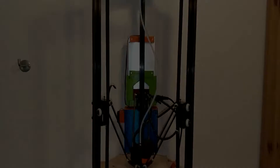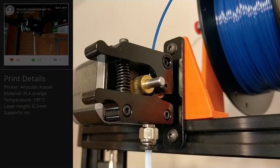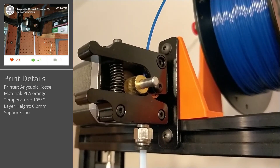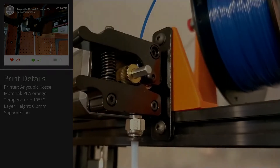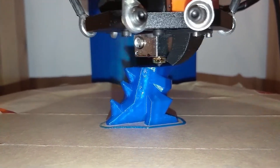The design not only reduces the printer's footprint but also makes it look very nice. I needed to adapt the extruder motor direction to get it to work, which is possible by either changing two wires on a plug or changing it directly in the firmware. A complete re-level was necessary to get ready for printing again.